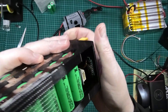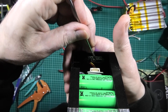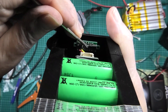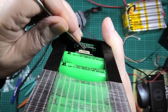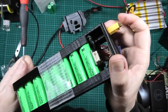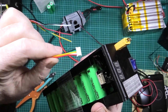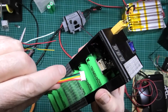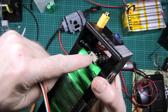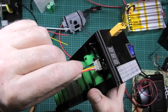The voltage display is reading a bit low. On the back of these modules there's a small pot — a trimmer potentiometer. Turn it one way to increase the displayed voltage, the other way to decrease it. Take your reading off your reference meter and adjust the pot accordingly to calibrate it. Now I'm going to wire the BMS up. Important: do not let the BMS wires touch the battery terminals while it's being plugged in — these things can just pop.